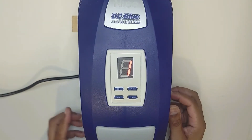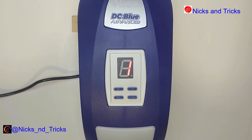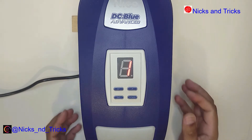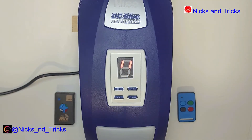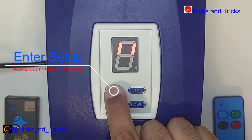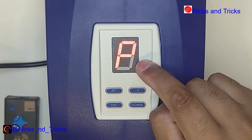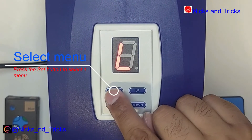After you've installed your garage door opener, there are a couple of things you need to take care of. The first thing is the limit setup. Make sure the door is closed and in the locked position, meaning the manual release has been locked in place. Press and hold the set button to go into programming.